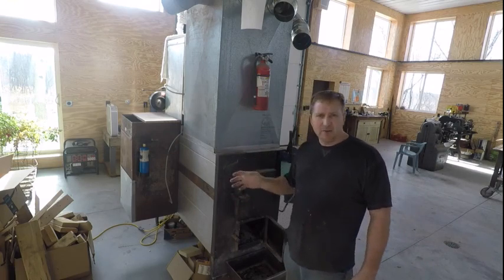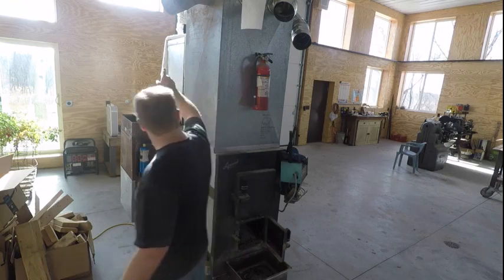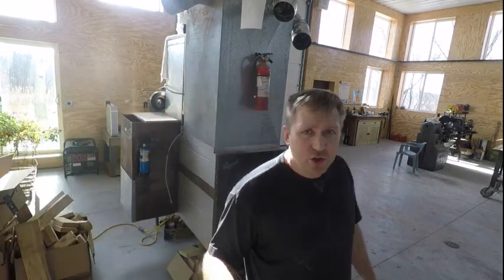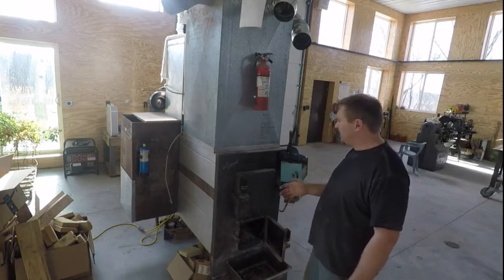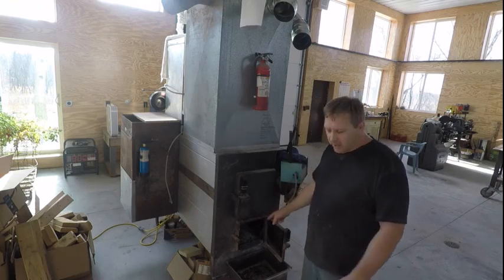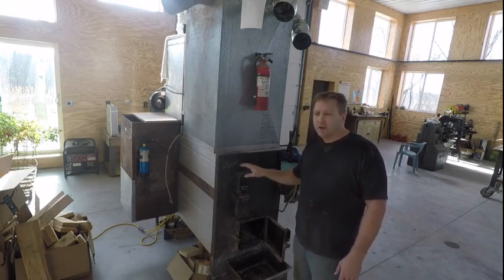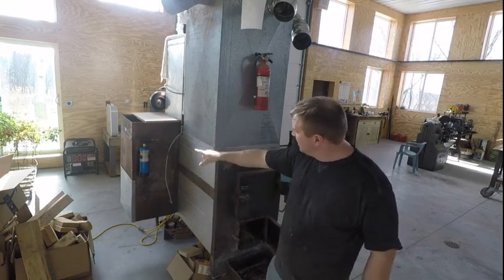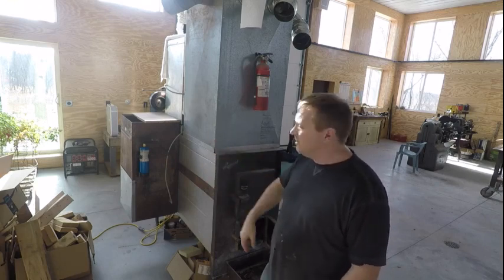Every spring, once I'm done running it - usually about mid-May - I open up my stack, run a chimney brush up and down, and clean out the chimney. You should clean your chimney every single year; I have a video about that too. Keep your ashes cleaned out - the book says don't leave an ash bed in here, because the coals radiate heat into the ash bed and since the blower blows through there, you don't want a lot of ash left. Always clean it every single time.